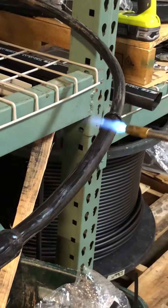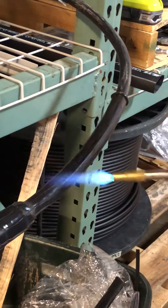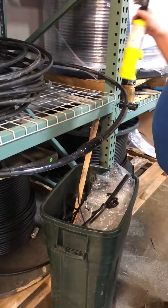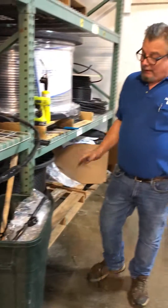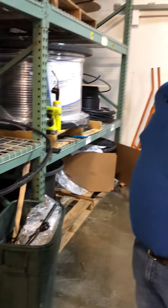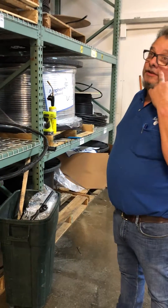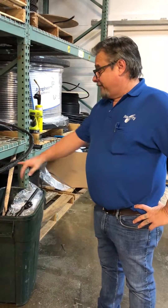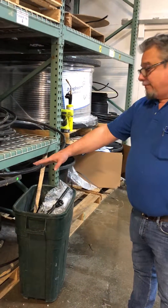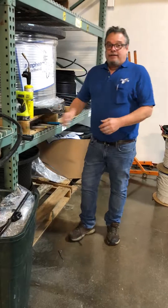Usually that last little piece will curl back over if we didn't get it. I think we got a good solid seal here. There's a perfectly done underground shrink job. I've never dug up a properly made underground splice that looks like this. A lot of people say they hate underground splices because they always go bad — every single one I've dug up either didn't have the shrink boot covering the bare cable, or it just barely covered it. You'll never dig one up that's sealed up this good. That's it.